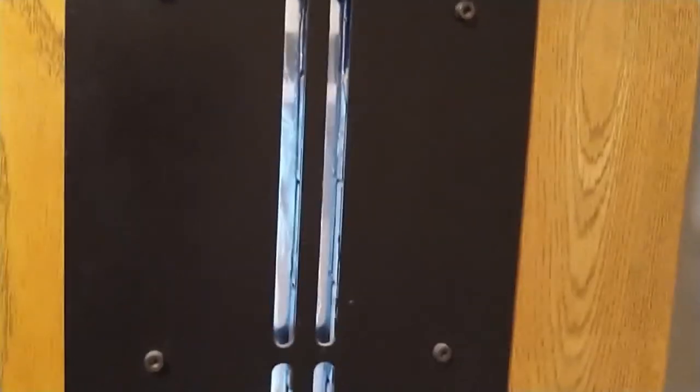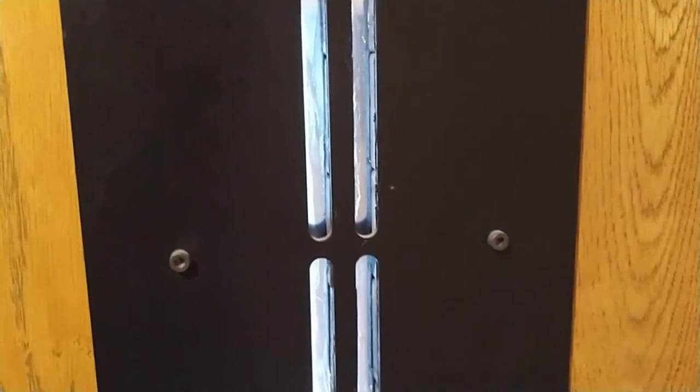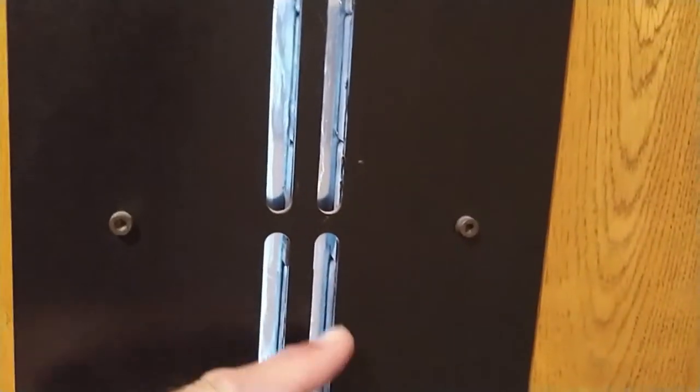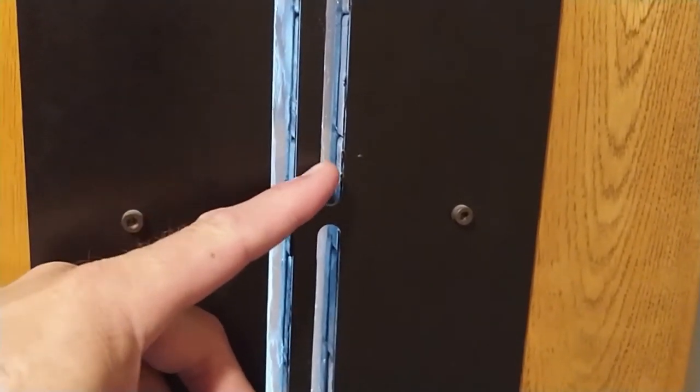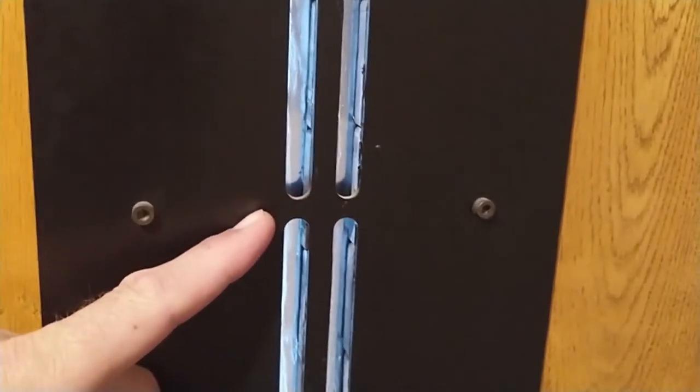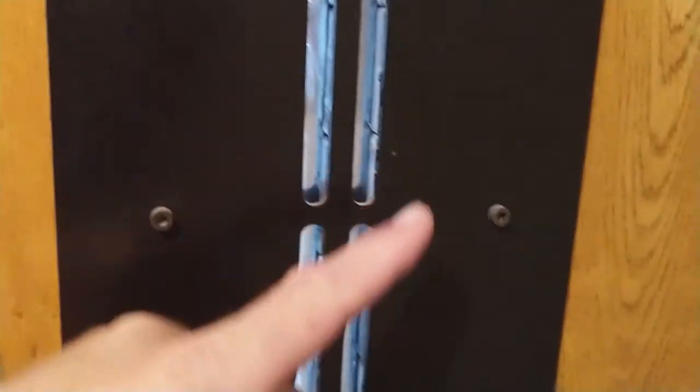On the back of the speaker — this is going to be kind of dark, I'll show more on how these are constructed a little later. Basically there is a mylar film that's suspended between three rows of magnets, and then there's a small copper wire that's bonded to the mylar. There is a wire on this edge, a wire on this edge, and two more wires — so there are four runs and they are basically doing a loop.